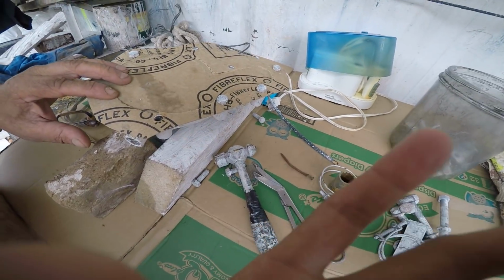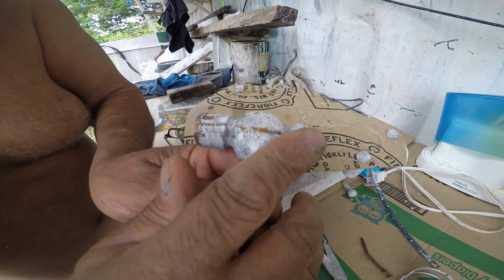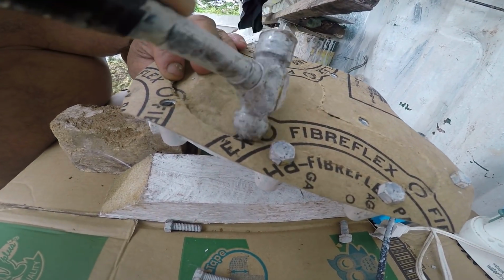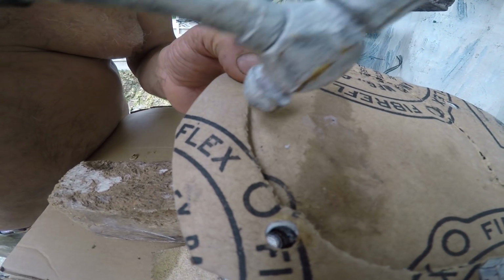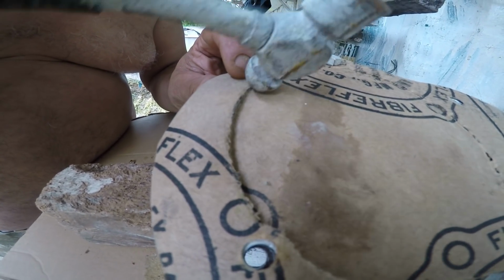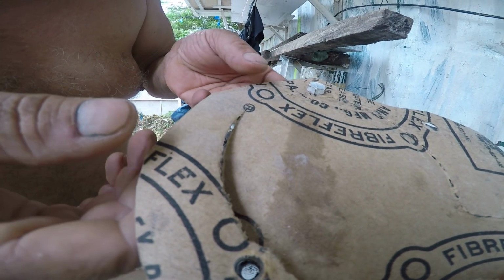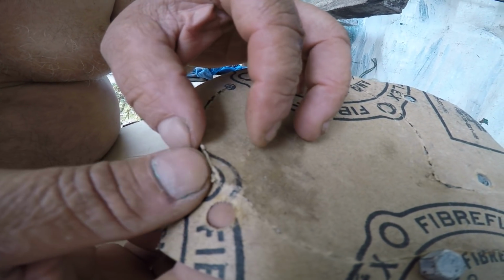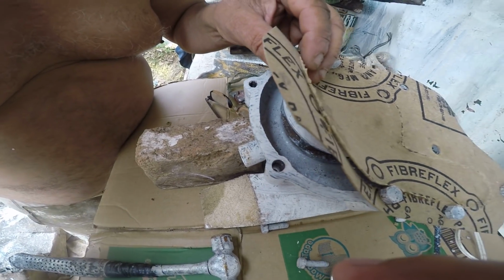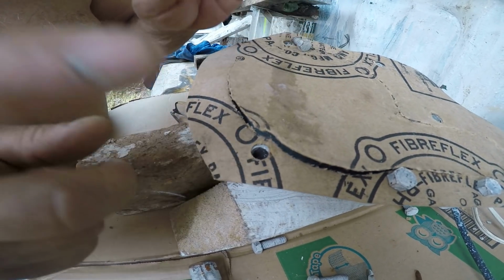Daisy, you hold this like this. One way is to use this ball-peen hammer, which has a rounded side on this side and a regular flat face on this side. Take the ball-peen hammer and go around the edge and keep tapping lightly, light taps, and it will cut it by squashing this soft material. And this is the product. It will make a rough edge like this. This is a rough edge because the aluminum is not hardened steel. Now that's one way.